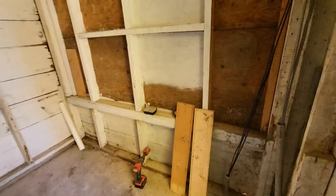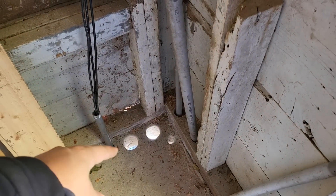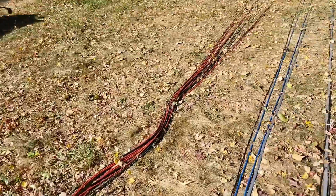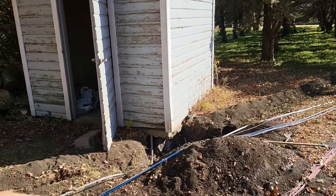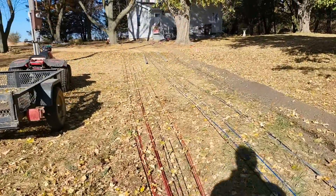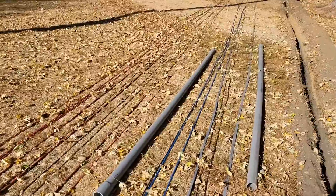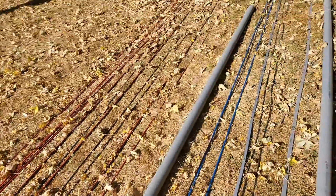For now we're putting the F3800s in the house, but we've got provisions in the shed. I was even thinking of bringing two-inch PVC up into there and back down to the house, but since these cables are so hard to handle I'm not sure it's practical. We might just run them straight to the container, or add the two-inch PVC positioned so I could later interrupt it. We are running our PV wire in PVC — even though it's rated for direct burial, you're shooting yourself in the foot without conduit. It is painful to buy though — each 10-foot stick is around $17 at Menards.